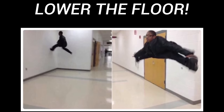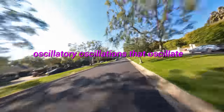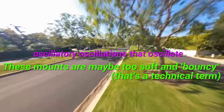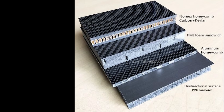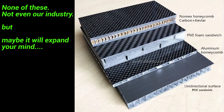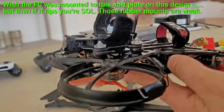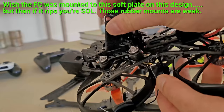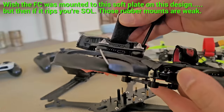A lot of people will say that if you have some sort of damping system on board, it's actually going to delay the movements and you're going to get oscillations here and there. Yeah, that is true, and I did experience that myself, but we need to figure something out in order to move forward. The trick is finding durable vibration damping. We often want to put something between the carbon plates and then cinch it down with bolts, which negates the whole point of putting whatever we did between the plates. The actual damping mechanism needs to be what holds things together — and the problem is that if you crash, the damping mechanism will most likely rip because it's got to be softer than carbon. It's got to be less durable to do its job, which is to generate heat from vibrations.